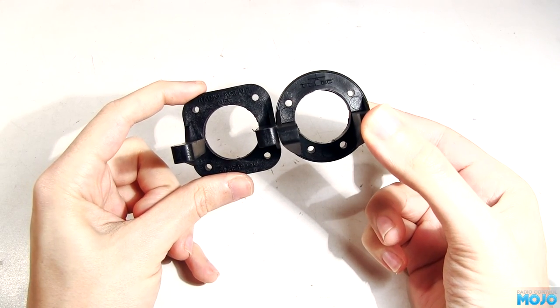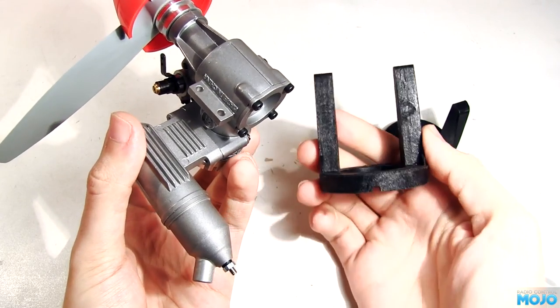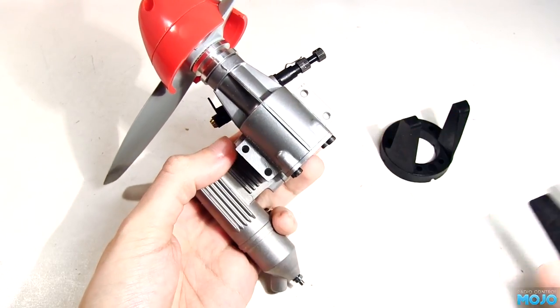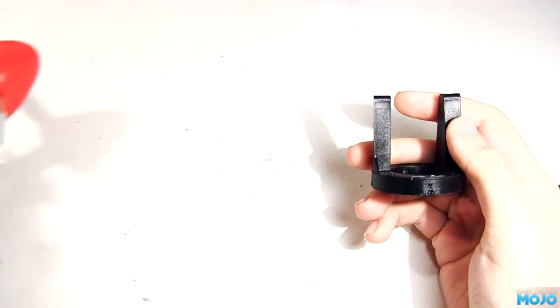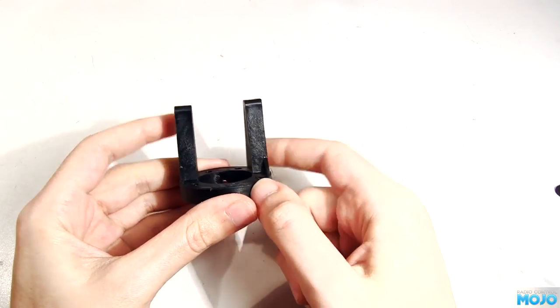But with all things, there's a problem. The Sleck engine mount doesn't quite fit the engine, and the next size up, which I just happen to have, is miles too big. But then, the fix is simple. Carefully trim just over a millimetre off the inside faces. If the bearers are wide enough, you can get away with it. As a rule of thumb, you should be able to get the engine lugs entirely on the top face of the bearers without overhanging. Otherwise, there won't be enough meat left for the screws.